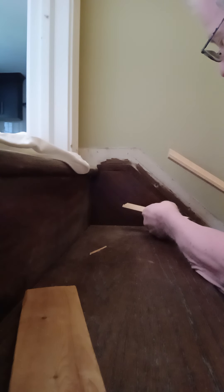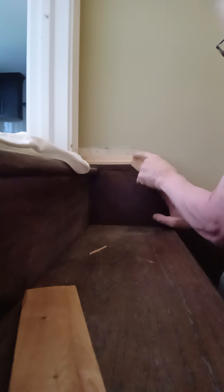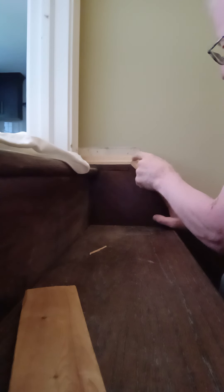So here are my two angles right here — they end up being like 21 and a quarter degrees. You lay your boards right in there and those two angles should line up perfectly, which you can see it's perfect. Well, there's nothing perfect out there, but you get the idea. So that's how you do a bisecting angle between the two.